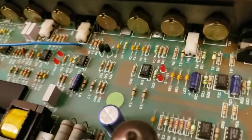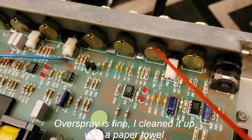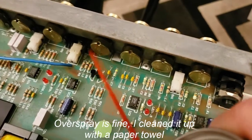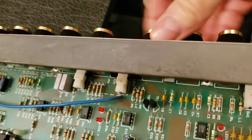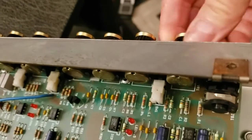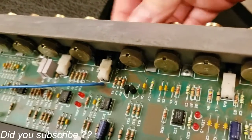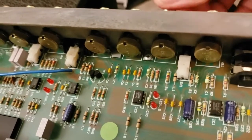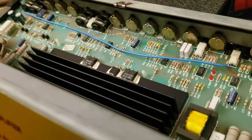Here's the hole we're going after right here — put some contact cleaner in there. I'll do a couple of them and squirt some juice in. Try to loosen them up here. I'm just spinning them all back and forth so I'll get the contact cleaner all inside of there. I'm going to continue to do all the potentiometers one after another, dry it off, and then do it again. Then we'll hook this thing up and see if it's scratch free.